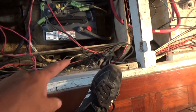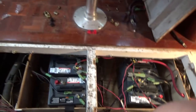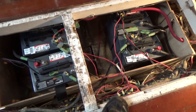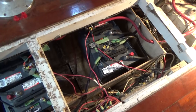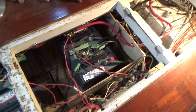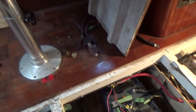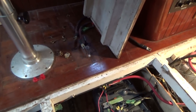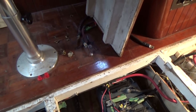They were looped over the edge and I didn't see them, so my sump pump didn't work originally. Bilge pump. Sump pump is in the house. So they didn't work initially, but I got that figured out. Once I figured out the pump actually worked when I bypassed the ground, I knew I had a ground problem. And I used my tester over here to figure out if I had a hot problem. I knew I had hot, so I just had to figure that out.